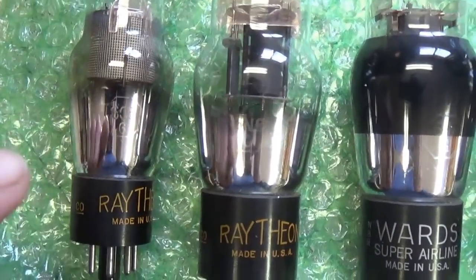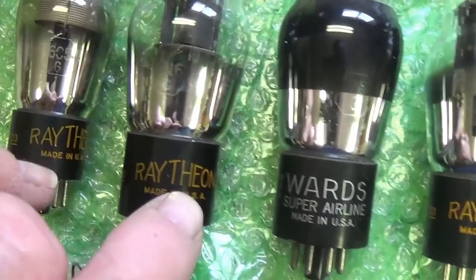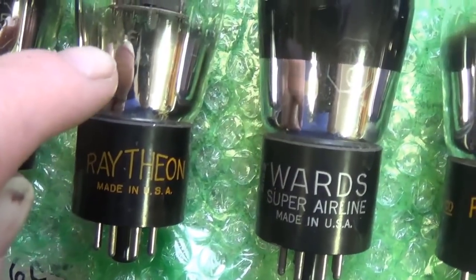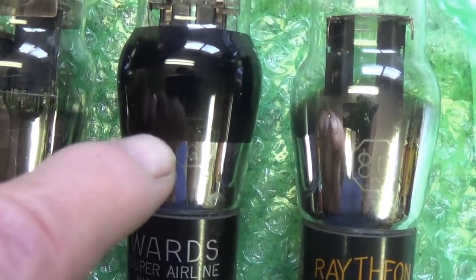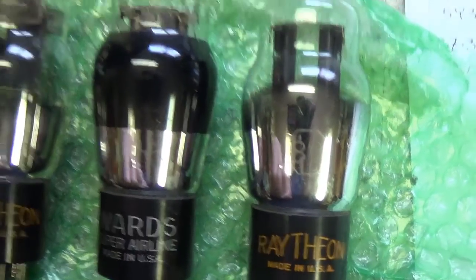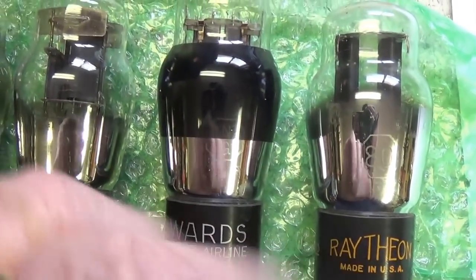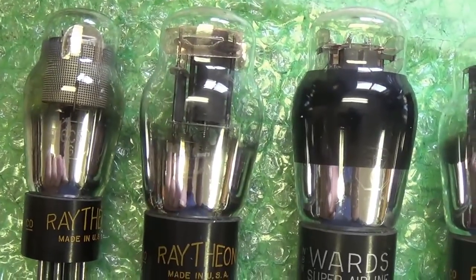Well, here we have the really nice looking vintage tube set that came in this amplifier. It's tempting to think that the three Raytheon tubes are original. This is the 6C5. Then we have the 6N6, the 6N7, which is kind of mysterious because there is no tube socket labeled for it, and then the number 80 rectifier. Now, since all of these tubes are rather unusual, let's go down the line, starting with the rectifier, and see how these tubes are designed internally and how they function.